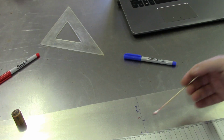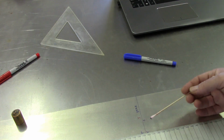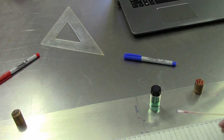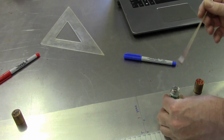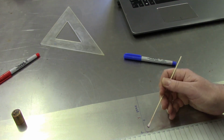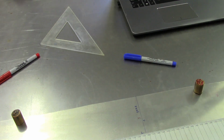Of course, whenever you make layout mistakes, a common thing to do is to grab a paper towel, a little bit of acetone, and erase that mistake. Sometimes the paper towels are a little bit awkward, so what I found useful is to keep a little vial of acetone and use one of these cotton swabs, and then you can just dip a little in the acetone. In this case, I want my tangent edge on that side, and it makes it very easy. You can just go in and do some fine erasing, where at least I found the paper towel doesn't work quite so well for me, or has a tendency to erase more than what I want.